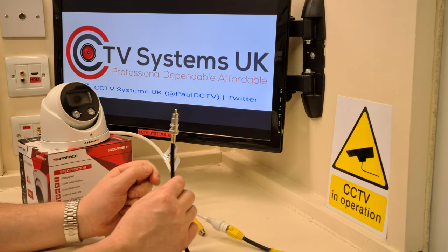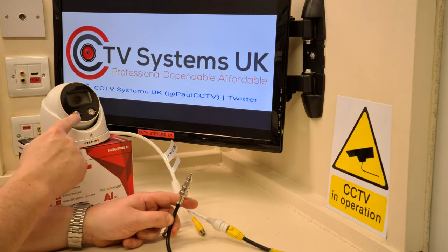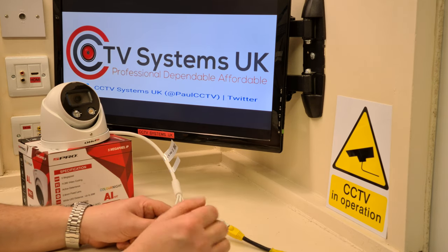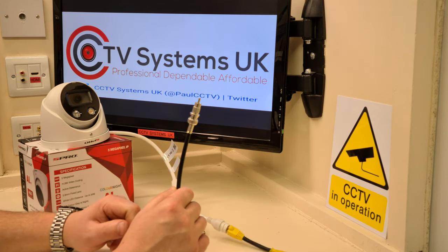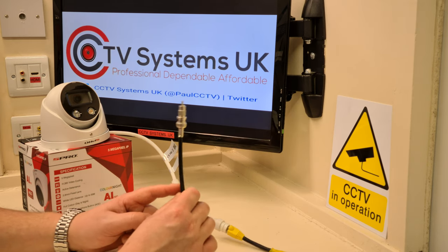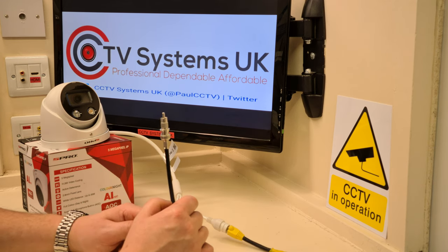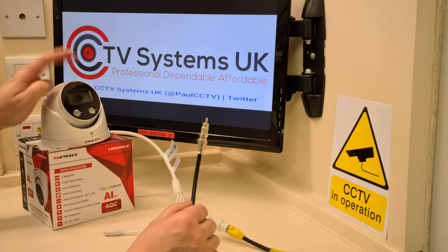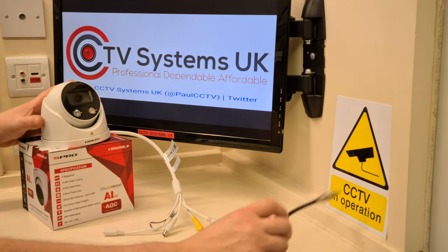So what I'm going to do first of all is, now that that's been powered up for a little while, I'm going to bring my tablet into view. I'm going to get the beacon to flash and the preset warning through the speaker, which is you are under surveillance. Then I'm going to connect this to an amplifier. You can hear how loud it can go, because obviously my amplifier is connected to a set of speakers like outdoor ones usually are. And then I'm going to walk out of the room, because obviously I've got a mobile device. I don't want it next to the microphone in this camera when I'm trying to speak, because you'll get the crossover. So, put that out of the way for a second.